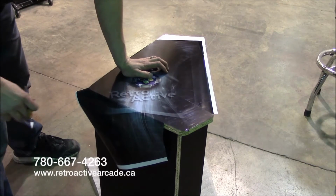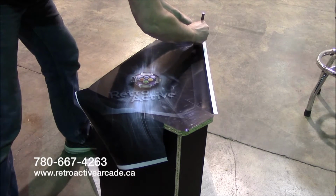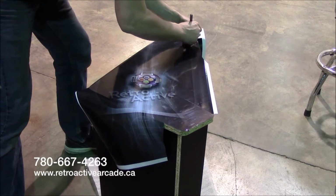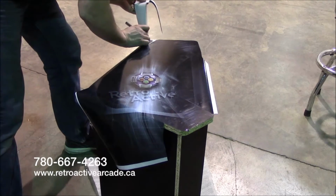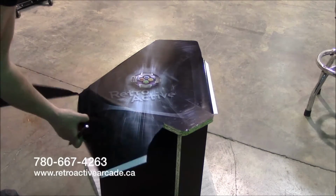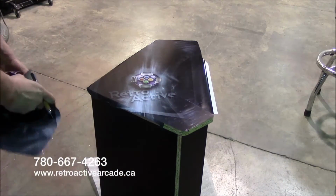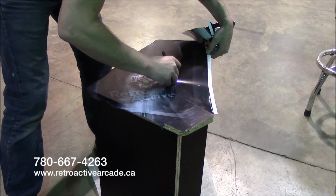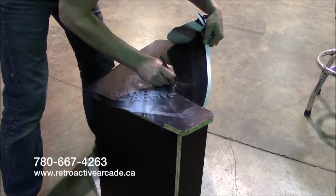But just to go over what I showed you before, just so you can see it again, around corners and the outside and stuff, you want to take a really sharp blade and just cut off all your excess. If you don't feel really comfortable doing it right to the edge right out of the gate, I usually cut about an 1/8, 1/16, 1/2 inch, that kind of thing. Just depends. You can go wavy, whatever you want with it, just rough it out so it's easier to work with. All that excess hanging off sometimes is a real pain in the butt. Just don't press and go really fast when you're doing this, especially if you can't see or feel the bottom underneath because you don't know where you're at.